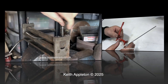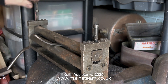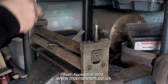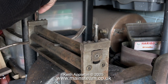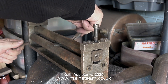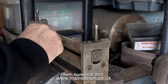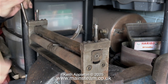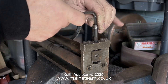This is a set of bending rollers — three rollers, and the top one is adjustable to put pressure on whatever's been squeezed through the middle. As you can see, I'm squeezing a piece of eighth-of-an-inch thick steel. It's most important when you're using bending rollers to make sure that you have a longer piece of metal than you really need, because you cannot bend the very ends of it. I'm bending this piece of metal to fit inside the firebox, and this is going to be behind where the mounting bracket is going to go.